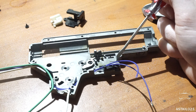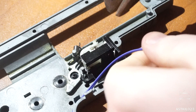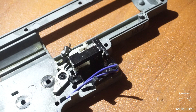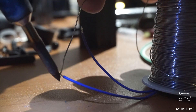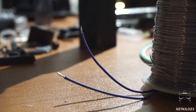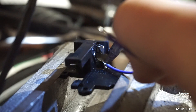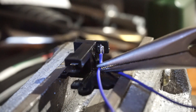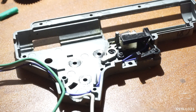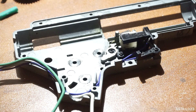At this point I almost have the gate wires measured. I'm going to go ahead and install the trigger switch, then cut the gate wire and re-solder. Your usual soldering practices should still be in effect — don't forget to strip and tin each wire as needed. Now we can install our two gate wires on the trigger switch. Bending the last wire and installing it with needle-nose pliers might be a little easier. You've now got the most difficult part of the install done. Getting the wiring in and the measurements done is the tricky part — once the gearbox is back together, getting the motor pins and connector on is the easy stuff.